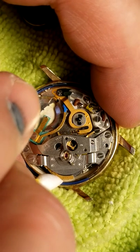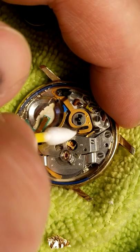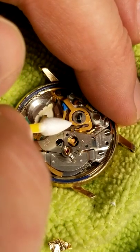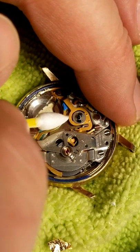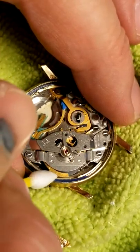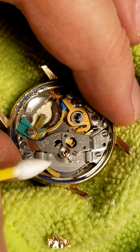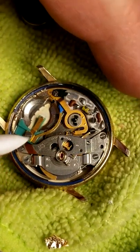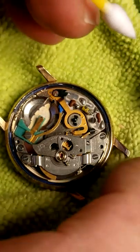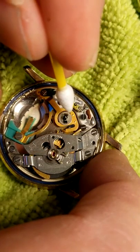It should rotate fully, but what it's doing is hitting a stop right here. I'll turn it sideways so you can see — it's hitting a stop. So when the crown is up, the pendulum hits this stop and won't go all the way back through. Now you might ask how that's an auto-start mechanism — watch what happens when I simulate pushing the crown down.